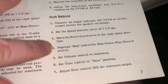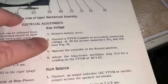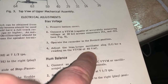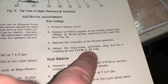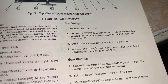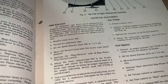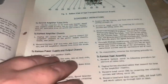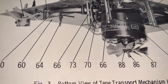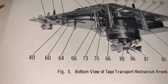The hum balance adjustment is done. Bias voltage right here — I was getting about 50 volts AC when connected, and I got it adjusted now to 60, so it should sound much better for recording. Everything else kind of fell into place. The motor in this is a Fasco motor with a badge on it that says Revere Camera Company, which was owned by 3M at the time.